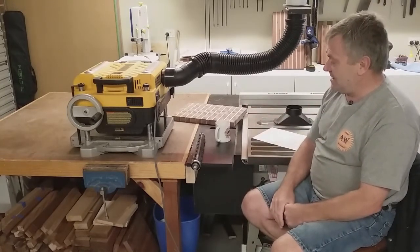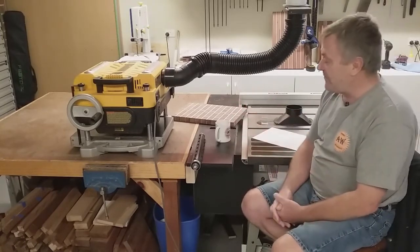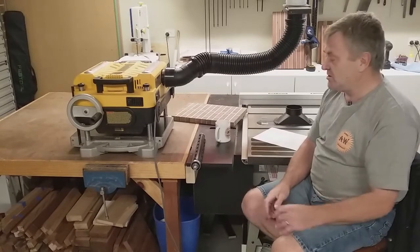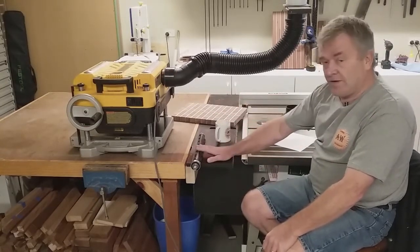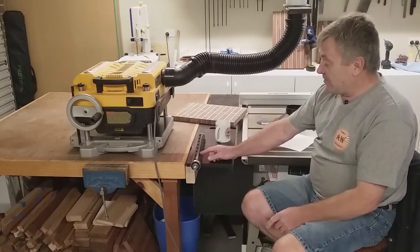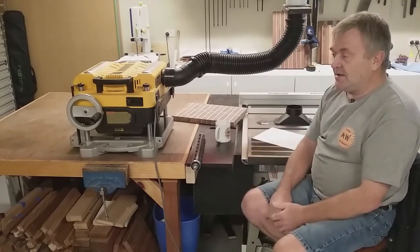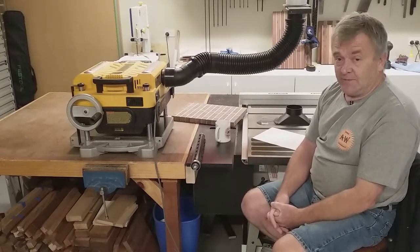As far as fitting the head, easy and straightforward, nothing too stressful about it. So why did I go down this path and not just buy a new unit and sell this one off? I've had this unit for a few years, and the previous one I had about 10 years ago — same capacity, same size — I burnt the motor out through a lot of use and overworking the unit. Over the years I've probably bought three sets of replacement blades for this cutter head. They're double-sided so you can spin them around, and when both sides became dull I'd use a timber block and run a whetstone over the top to polish the edge back up and get a little more life out of them before buying a new set.